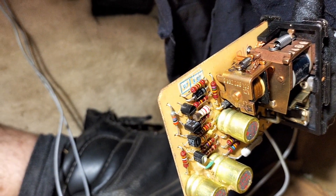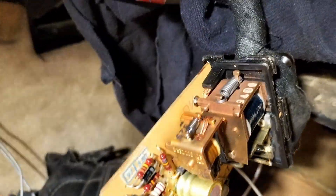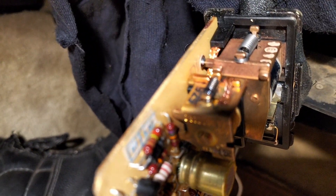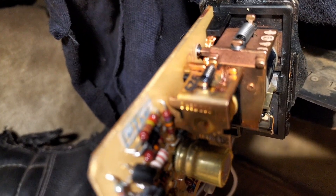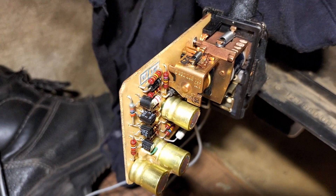You can't see it very well, but there it is. So every time I flip that switch, once the car is turned on, you can flip that switch and it will activate the glow plugs. So now it's a manual glow plug system.